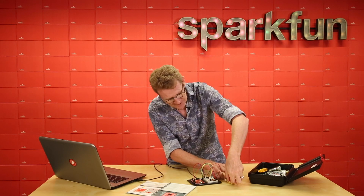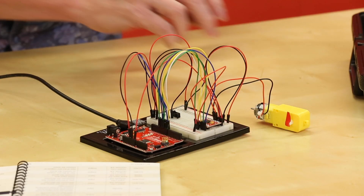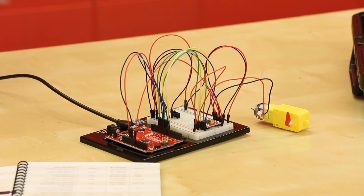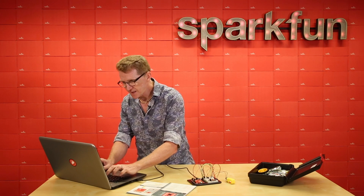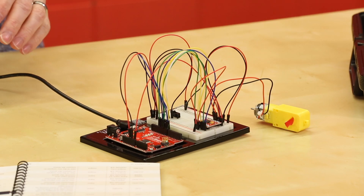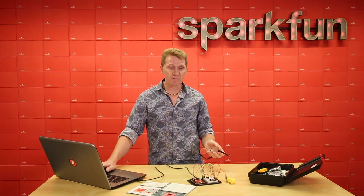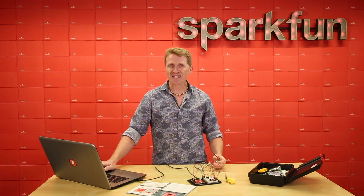Just to make it easier for everybody to see, I'm going to put a little piece of tape on here and we'll do it once more: 255. And there we have it. It's just that simple. We can slow it down to 125 and send that. What about 50? Back up to 255. So there you can see how easy it is to control the speed of a motor using the red board and a motor driver. Let's move on and see what we have next.